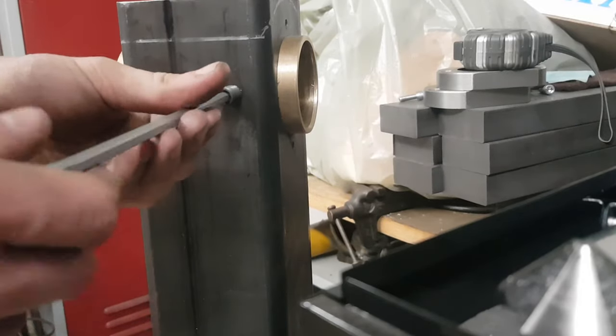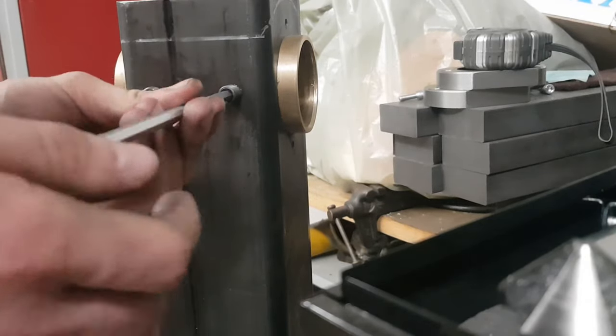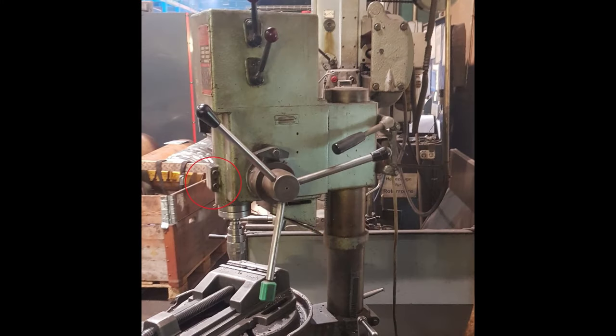To be honest, a much better way of locking a shaft into place is like they did on that picture of a drill press. If you tighten those two screws, the force you are applying grabs the quill around its circumference and is better distributed. If I run into problems with my design, I might add something similar in the future.